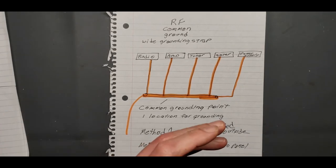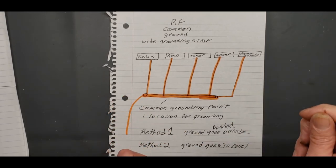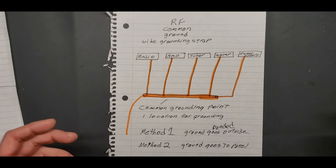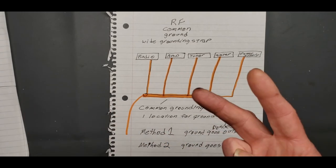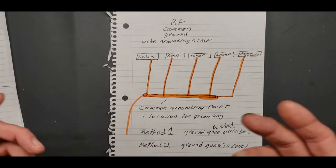So you visualize, okay, my antenna's over there. I've got to bring coax to here, because here's my ground rod. I need something to hook to the ground rod. You need a lightning arrester. That'll give you a pass through. You hook that one up, then hook another piece of coax, so you'll have to think, okay, I'm going to need two pieces of coax, not just one, okay? Because when you hit that lightning arrester, you're splitting your coax. So you're going to need two pieces of coax. And then you're going to bring that into your shack or into your room, whatever.